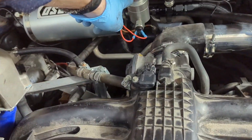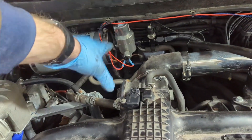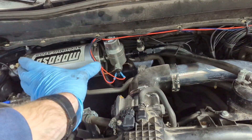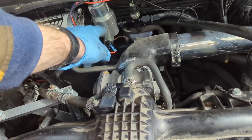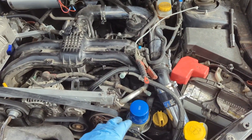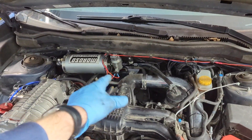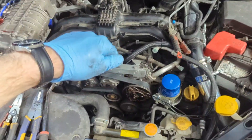This is a one-way, electronically controlled valve where even when de-energized, oil is allowed to flow into the accumulator. When low oil pressure is detected in the system — which would happen if an air bubble were sucked in through the oil pan, through the pump, causing a pressure drop — that valve will open and oil will be allowed to flow in reverse back into the engine.